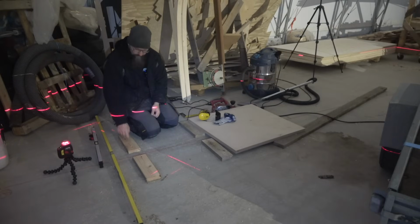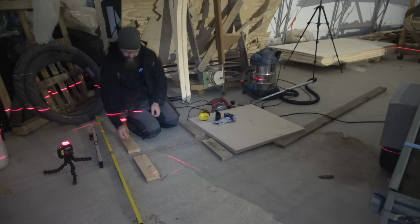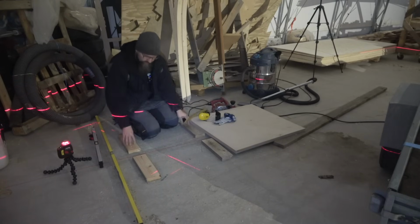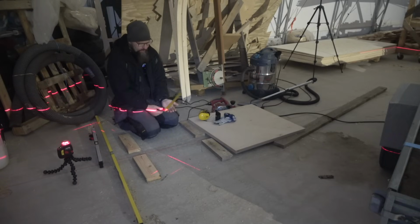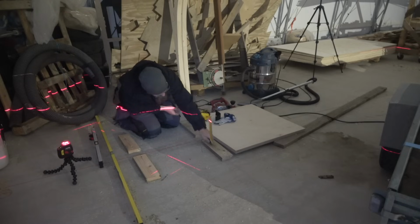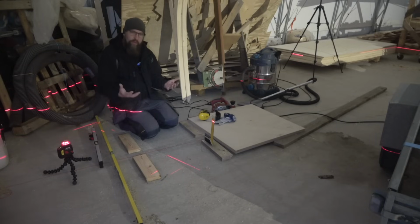Okay, these are now done, except for this one. I made a little bit of a stupid mistake. It's quite easy to confuse which direction you should move this to get it right. So, yeah, it didn't take that long to do these. Of course, they are quite small and short compared to the big ones in the middle of the boat. But it's not really that easy to make the quality of these very good. So these are now maybe within 0.5 millimeter on the same level. So it is doable. Now I just need to think about the quality, amount of work, money, all of these.